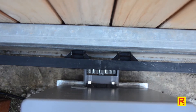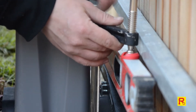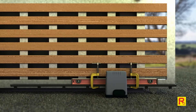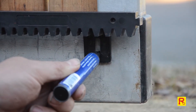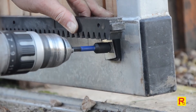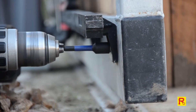With the gate fully opened, place the two lengths of gear rack on top of the motor cog. Clamp your spirit level to both lengths of gear rack and use the level to ensure the gear racks are parallel with each other and the gate, as shown here. Now, using your marker, mark a point in the centre of the gear rack's mounting flange. Pre-drill these marked positions using a 5-5.8mm drill bit. Use the supplied self-tapping screws and square washers to secure the first two lengths of gear rack to your gate.